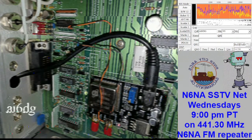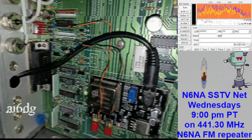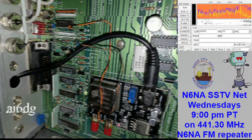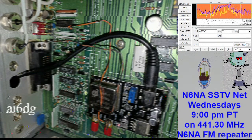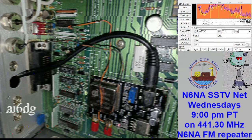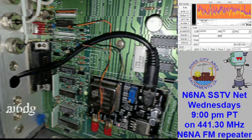I got 2 of those oscillators. I'll probably use the second one as the frequency standard for my Flex. I was going to use it on other frequency counters I have floating around, but they all seem to want 1 megahertz instead of 10 megahertz. I guess technology has changed and everything uses 10 now, and back then it was all 1.